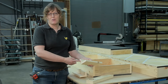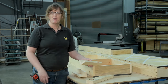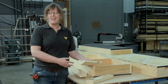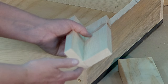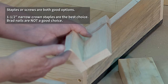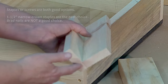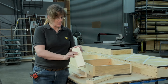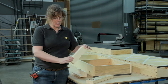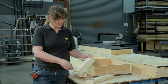If you've never been on a farm, you probably don't know what a hog's trough looks like, but it really is a V-shaped trough that people just throw food in and the pigs eat the feed out of. So a hog's trough is basically one piece of one-by stapled and glued to another piece of one-by at a 90 degree angle. You do need to glue and staple, and accuracy matters here because the cleaner this is, the nicer everything looks, and the better the compression of the joint is, the more stable it's going to be.